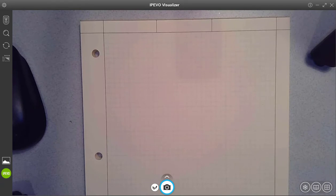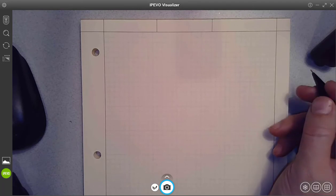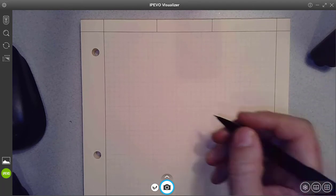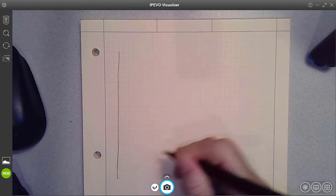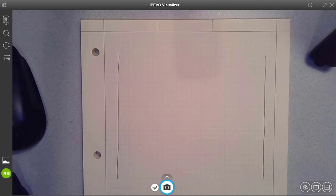And actually, before we connect to the PLC and the computer, I want to think a little bit more about the logic that we saw demonstrated in that really basic program that came in your PLC. Just to review how we look at ladder logic diagrams. So reviewing back to MEC 133, or as a quick overview for those of you who may not be as familiar with them, a ladder diagram is a way to document the control side of an electrical control circuit. It doesn't have power devices on it. It only has input devices and control output devices.